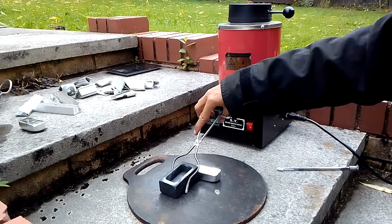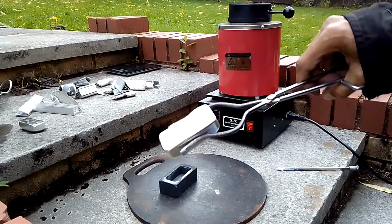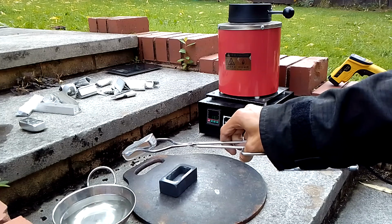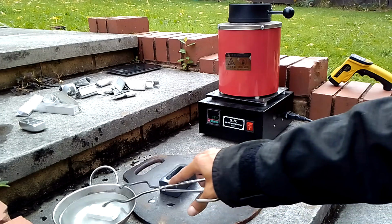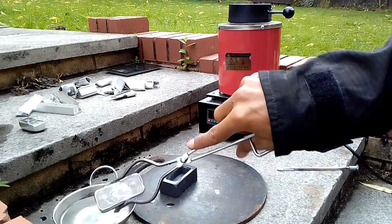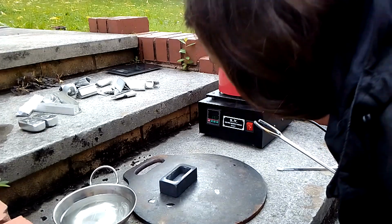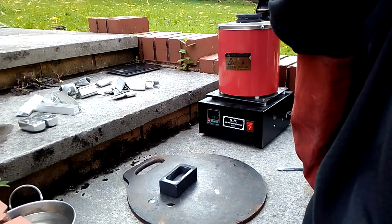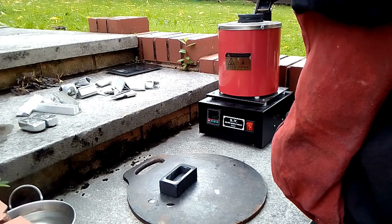So next ingot. Wow, beautiful. Look at that. Very, very shiny. So quench this. I'll bring the quenching pool over here so you can witness the quenching this time. Listen to them sounds. So that's heatsink cooling from 850 degrees, which is what it's melted at. It's actually 848 at the moment. That is because of that giant chunk of heatsink I just added, which has melted, and the crucible is still not full. Damn it.